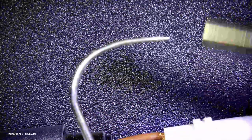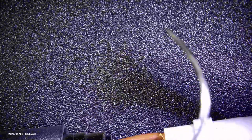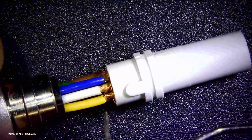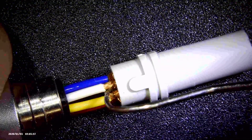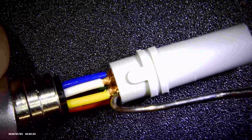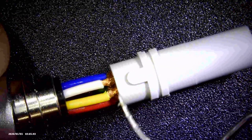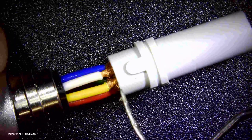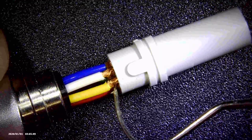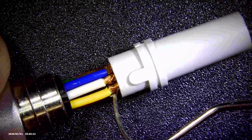Here we have the hook — I'm cleaning the glue off it. Anytime it gets dirty, you just heat it up with a heat gun and it makes all the glue liquefy. We're going to use this cleaned hook to situate all the little strands. Here you can see I'm poking the yellow strand back towards its base — just got to get it away from the outer edge because we don't want it to touch the shielding, which will be a collar that fits around the outside.